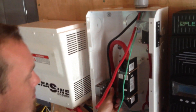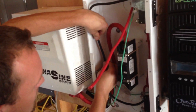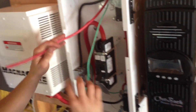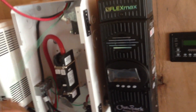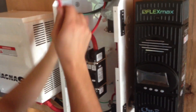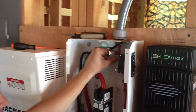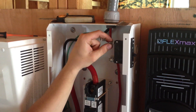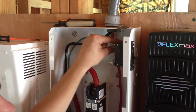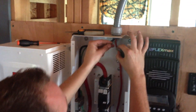So this negative — we had just enough space to run it right to our neutral grounding block here. That was my main concern, that we didn't run out of the black wire, and it looks good. This also goes to the neutral grounding. You want to bend your terminal wires in place so you don't put any tension on the post of this breaker — it's really weak. Got it all bent so there's no tension on the screw. It slides right on and you put your washer on top of that.